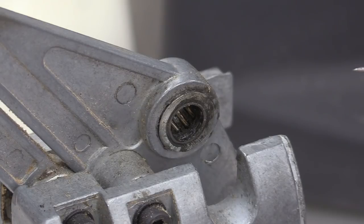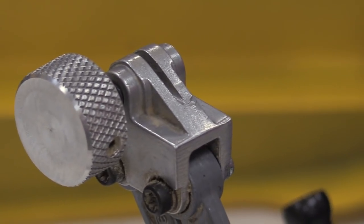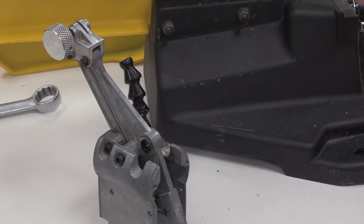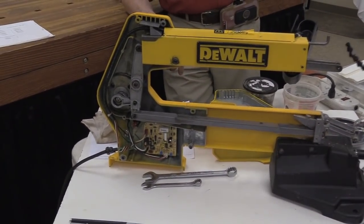Okay, while we're talking about bearings and sleeves, we've got within here 12 identical bearings. There's one inside of there, same spot in the front, another one inside there, one inside this part here, and then two of them, one on each side over here, for a total of 12 bearings. They're distributed between these two rockers, the horizontal rockers in the front and rear, and the remaining two bearings are at the end of the linkage. Are all those similar, Bob? They're all identical. Okay.